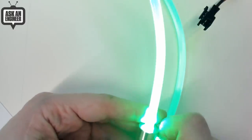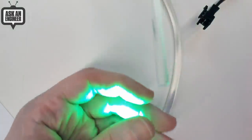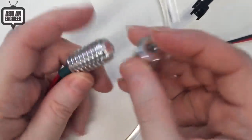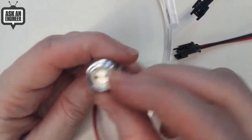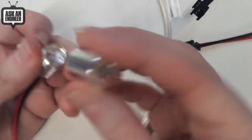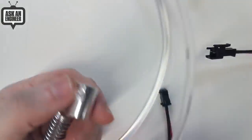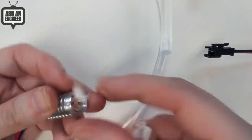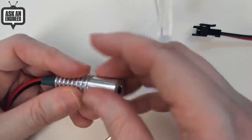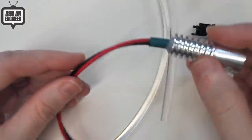There's already a request for an ultraviolet emitter — that'd be kind of cool. You can actually take apart the emitter if you want. You can put whatever you like in there — the emitter is basically just an LED with a heat sink and a clamping mechanism, so you can replace that part. It has a little lens and heat sink, and the clamp holds the tubing in place. You can also cut the tubing — it's just plastic, so use diagonal cutters. And if you want a really nice effect, you could have two different colors on each end. You can also PWM the LEDs, which you can't do with EL — you can't dim EL. But with this, of course, you can dim all you like.